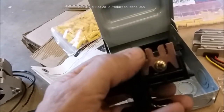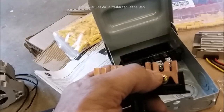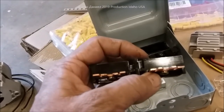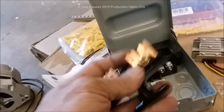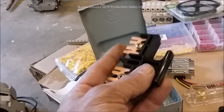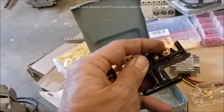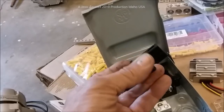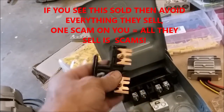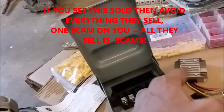The staggered tabs inside have a specific reason: they're designed so there will be a burn-through. Notice one tab is slightly thinner than the other — that's intentional. It's purposely made to destroy itself: it'll roll backwards and pull itself away from the contacts. At 66 to 70 amps continuous it'll handle an 80-amp surge — at 240 volts alternating current. This is an AC safety device, not a DC solar disconnect.